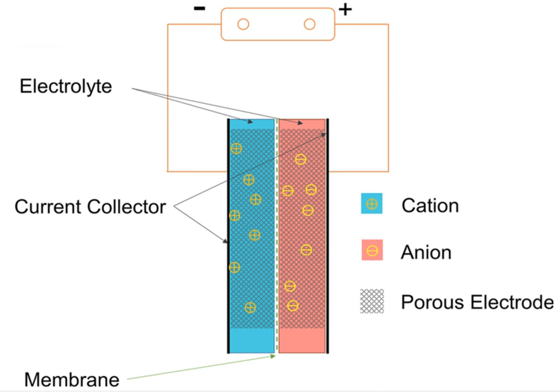Energy capacity. Supercapacitors occupy the gap between high-power, low-energy electrolytic capacitors and low-power, high-energy rechargeable batteries. The energy W_max, expressed in joules, that can be stored in a capacitor is given by the formula W_max = ½ · C_total · V_loaded².